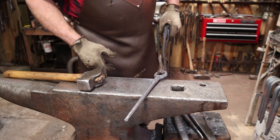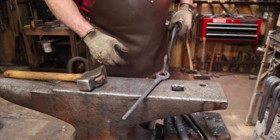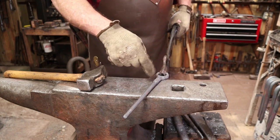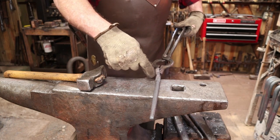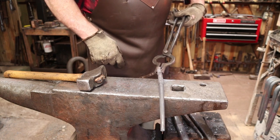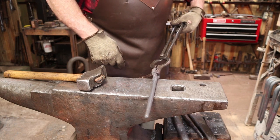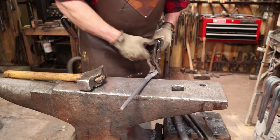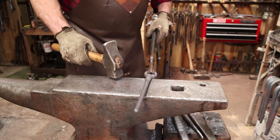Could easily turn that into some kind of an eye bolt or something, but this part will become the hook on the top of the cylinder. This will all be hidden in the cylinder, and I'll electrically weld wherever that joint is on the outside, just because I think it will be the most expedient and it will solidly bond everything to guarantee that it rings as well as it possibly can.